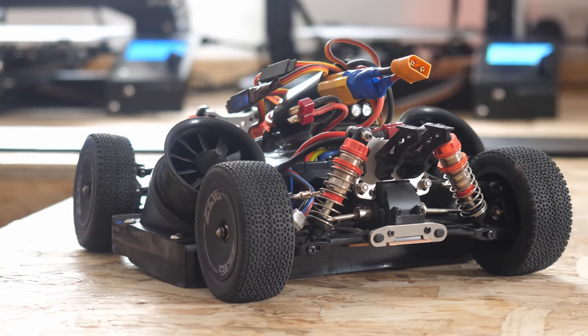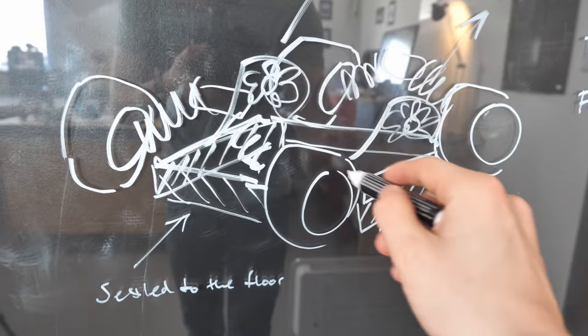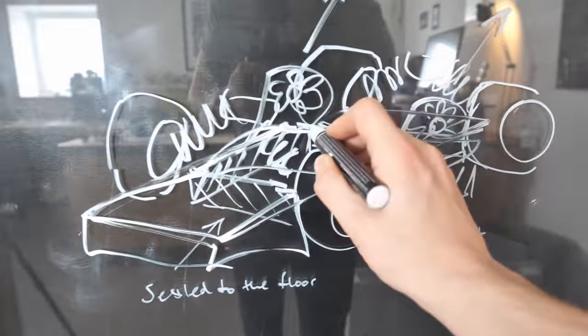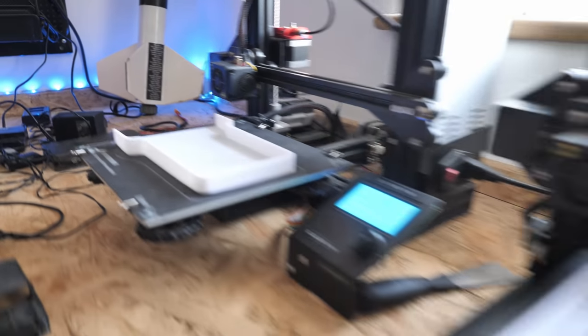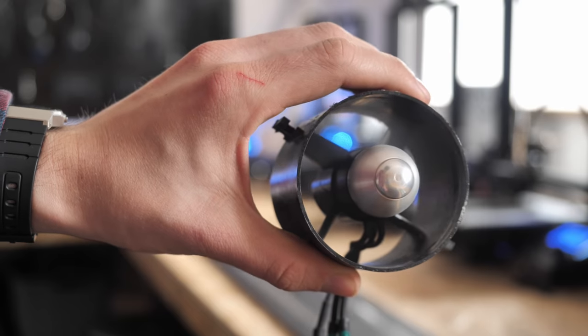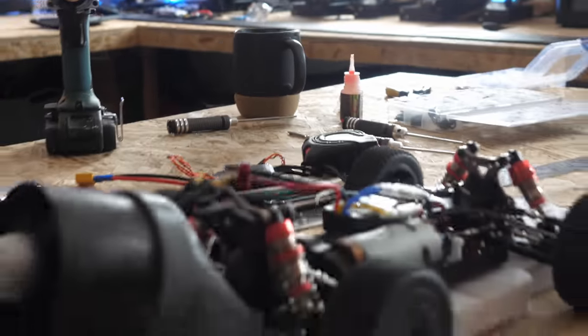To get more performance, I needed to go bigger. The ground effect area was only so large, and I realised I could make it way larger. Channelling my inner Gordon Murray, I designed a much larger floor with more than twice the volume of the previous design, extending the solid sides down to create rigid skirts, and extending the bed further forward and rearward between the wheels. I also made the car lighter by using a larger, more efficient fan on the back. After a lot of tea and a lot of work, the car was almost ready.